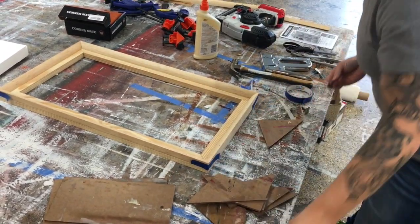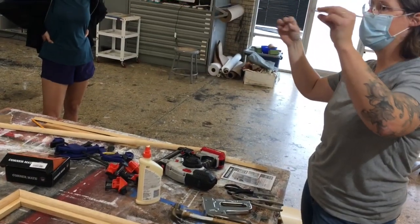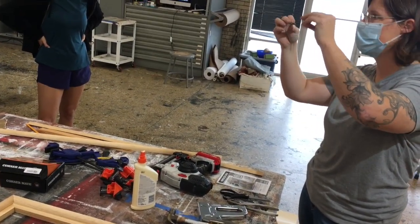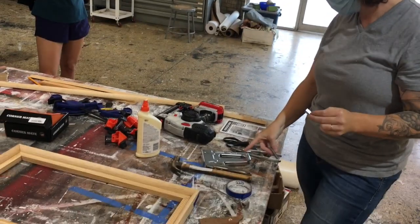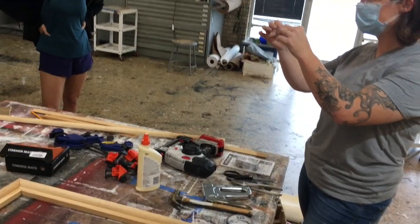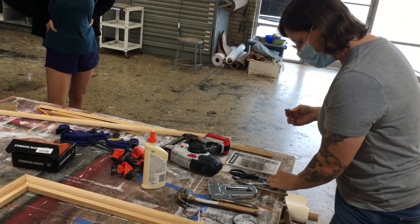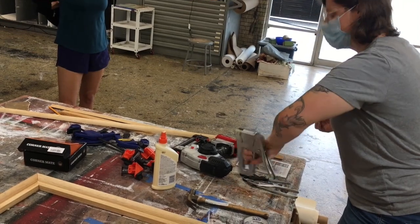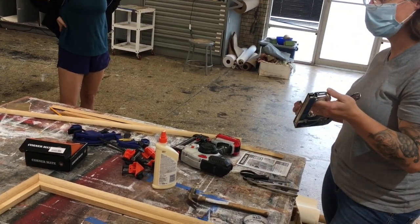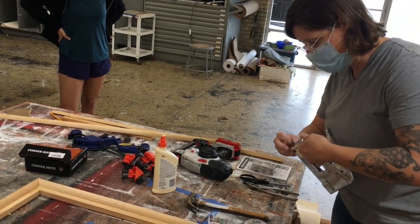And you're gonna notice that sometimes the staples are different sizes. Do not ever put in different sizes of staples. The staple, and this is T50, only goes to T50 staples. But T50 staples come in different lengths, short and long. And I'm just gonna use the short ones here and make sure that it's all clear, because that's the cardinal rule. You're gonna break a staple gun if you put different sizes in. You'll never be able to unlock that.